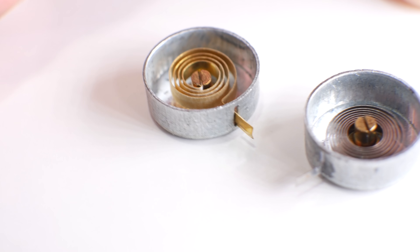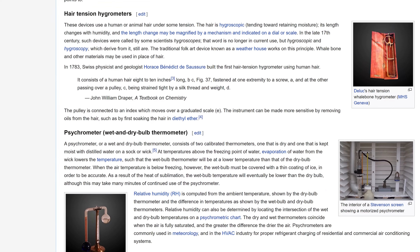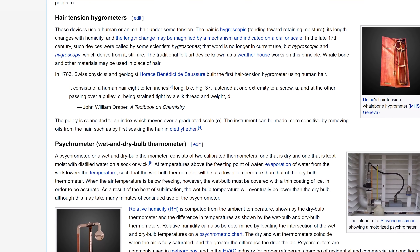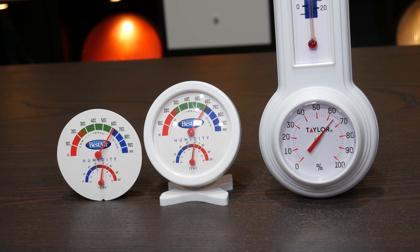This melding of paper and metal isn't the only way to go about it, of course. In fact, it seems to be a rather newfangled way to do it — presumably it's just very easy to manufacture inexpensively. All you really need to make a hygrometer like this is some sort of spring that's pulling on something else which will deform based on humidity. The first hygrometers that worked on this principle used actual human hairs. The hair would lengthen with increased humidity, reducing tension on a spring or pulley, and thus allowing an indicator of some kind to move. As it dried out, the opposite occurred and the indicator moved in the other direction. This style of hygrometer is still made, but it's a rather specialist sort of thing. However, they can be quite accurate when calibrated — with one manufacturer claiming accuracy to within one percent at room temperatures — although I found other sources which aren't quite so optimistic.